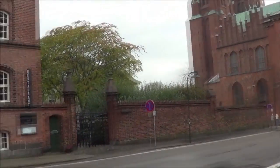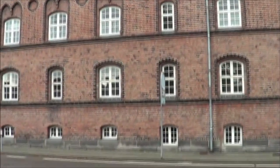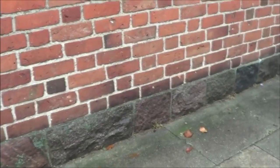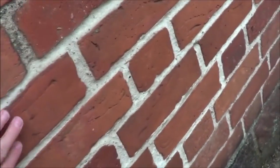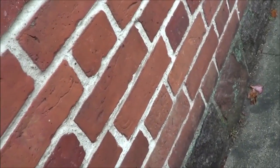We're in Roskilde, Denmark, and a lot of the buildings are built out of brick because they always had a problem getting wood. You can see right here where the brickwork is, and at the bottom of the brickwork they usually put granite — what we call a water table. Right here they patched it, you see that. So one of the things I want you to notice is this is a glass-type face brick, and all they do is put the cement in and sponge it. Because it's kind of glass it doesn't really stick. I think that's genius — there's no right or wrong way to do brickwork, but I'm a big fan of that.